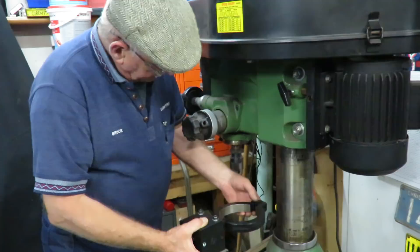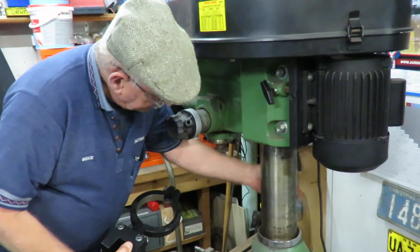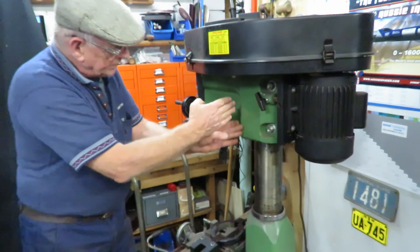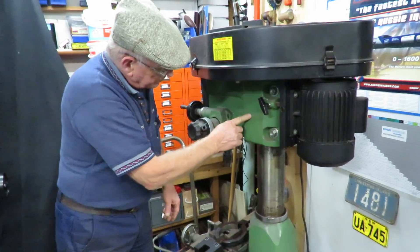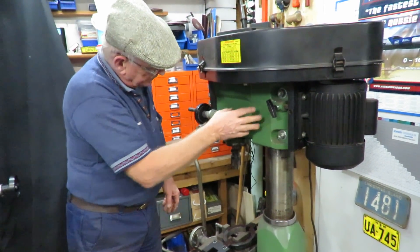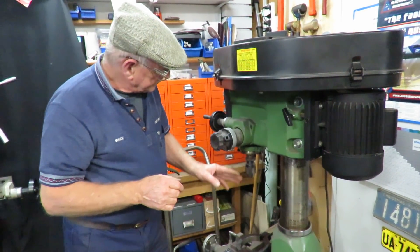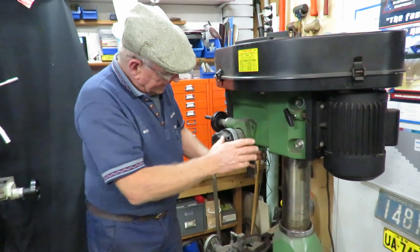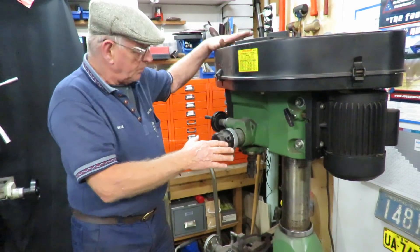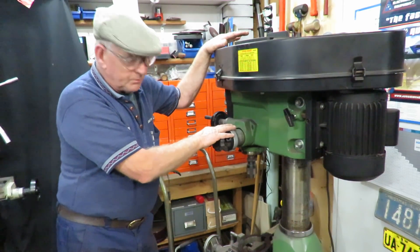In this case, we bolt it around — there's a slot to go over the rack — then we line everything up, set it all up, drill and tap the holes. We don't have a bracket here, but we drill the holes and put the taps in, which is shown on both our previous videos. That then allows the Rongfu simple mill drill style — and there are many of them around — to be able to tram it up and down in a plane.